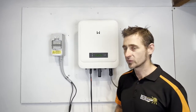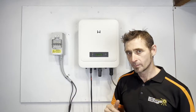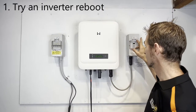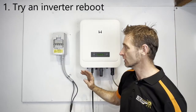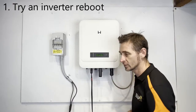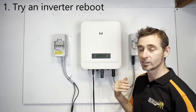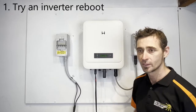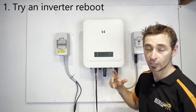If you've gone through all those steps and your inverter is still not coming up with a solid orange light, there are a few things I recommend you try. First off, try rebooting the inverter. To do that, shut down the AC from the system — you might have an inverter AC isolator like this one, or it might be an inverter supply main switch in your switchboard. Shut that off, then turn off the PV array DC isolator, which is usually built into the bottom of the inverter — the switch which just turns 90 degrees. Within 30 seconds or so the inverter will shut down completely. Give it 30 seconds after the screen's gone completely blank, then start it back up. The order to start it back up doesn't matter, just as long as you turn everything back on. After a few minutes, see if that reset makes the inverter come back online with the orange light on solid.